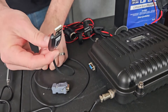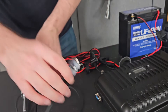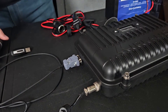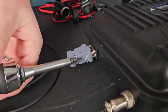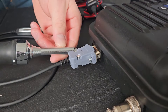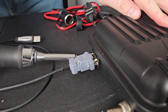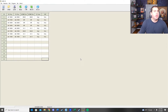The programming cable is USB and plugs into any laptop or computer. One important note: the first time I went to program it I didn't tighten the screws on the cable connector. If you don't tighten those screws down it will throw errors and won't take the programming. Make sure you tighten the screws — it's a weird quirk but it matters.